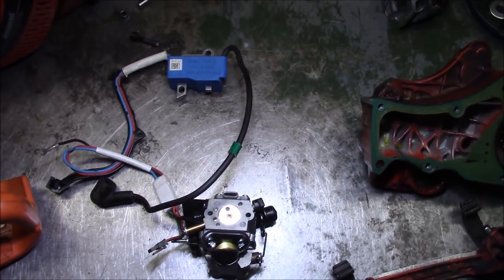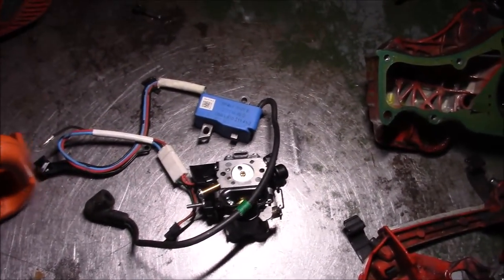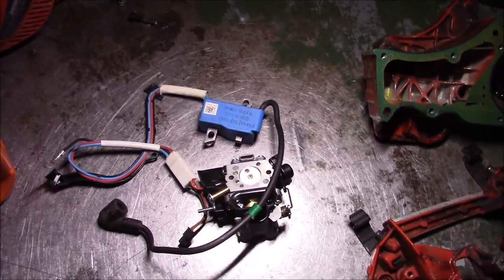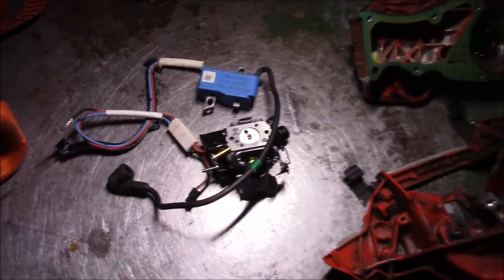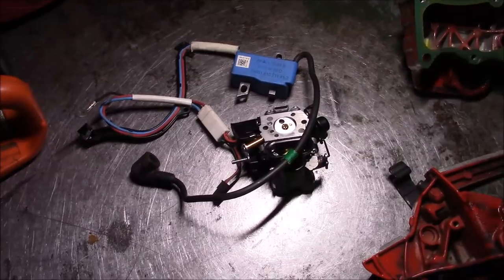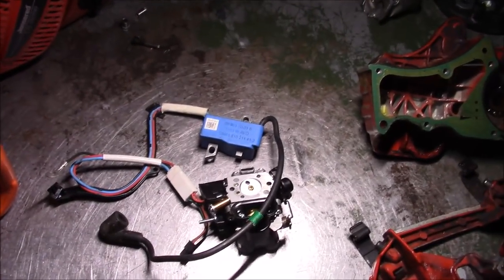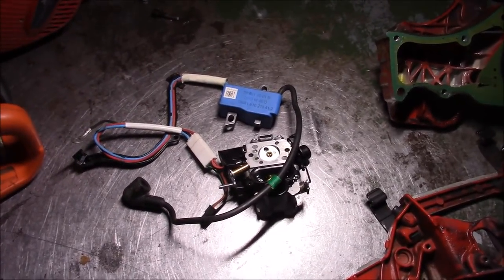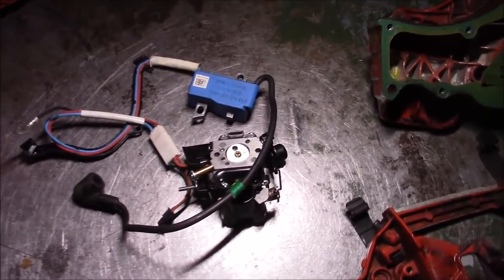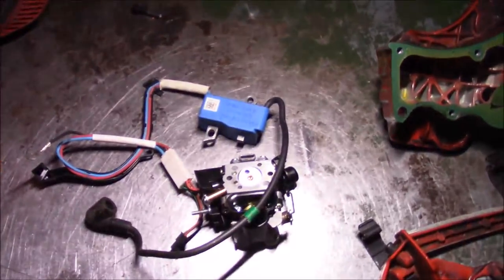While the saw is doing its lean-out test and depositing information to be looked at later with CST, I want to stress that's just another source of information. Common Service Tool doesn't replace the need for good mechanical skills. Obviously, error codes give you documentation to point you in certain areas, but it doesn't eliminate the need to do things like vac tests, compression tests, and all that. It's just another layer of information you can use to evaluate the saw and sometimes get to a solution a lot faster than conventional strategies alone.